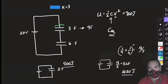The problem works in this way because while connected to the potential difference, the one thing we never talked about here is what's happening to the charged particles. And that's making a difference. The reason why when you go to try and push this dielectric in between the plates, while there's a potential difference there, there is an electric field there. And that electric field is applying a force to the charges in the dielectric. And it's opposing their motion into the field because there are charges there.